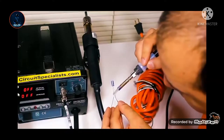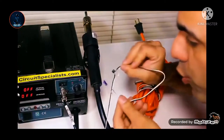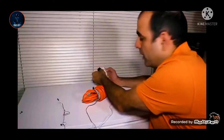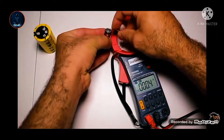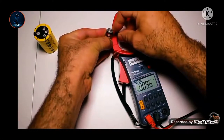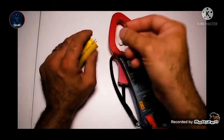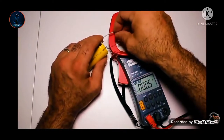I connect the capacitor to a cable that connects the 120 volts to the capacitor through a push button. Super dangerous, don't try it at home. Let me demonstrate. First, short the AA battery and see how much current it can deliver. 9.6 amps. Now let's short the super cap. Of course, the resistance of this wire is gonna limit the current through the super cap.